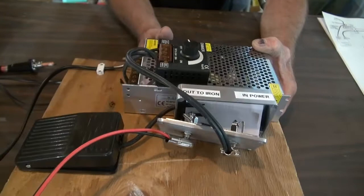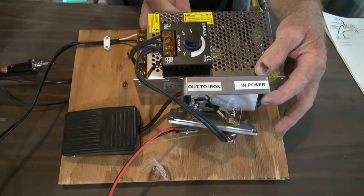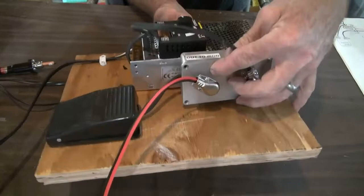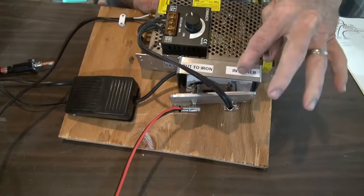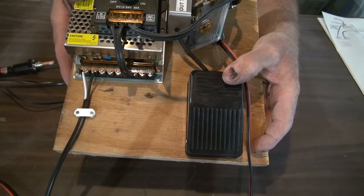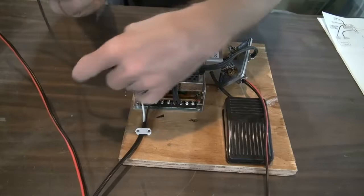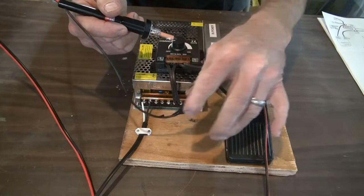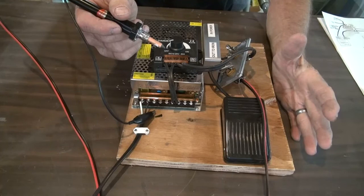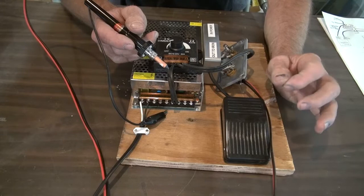You don't have to go to this extent — you can hardwire everything if you want. But where you're doing your connections, I still suggest buying a little hobby box that you can screw down. I labeled what plug goes where. Then I've got my foot switch for turning the power on and off, so the whole unit will be on the floor. When I touch my soldering iron to whatever I'm soldering, it's grounded with the alligator clip, then I hit the power switch. It heats it up in that specific area and I solder it. What's neat about these resistance soldering systems is you don't heat the whole entire part — you heat just the specific area you're soldering. Really slick.